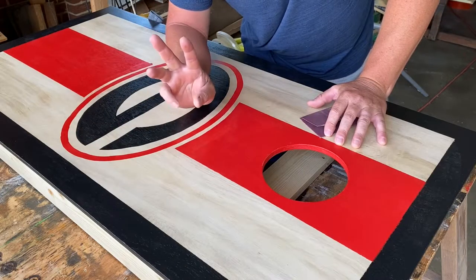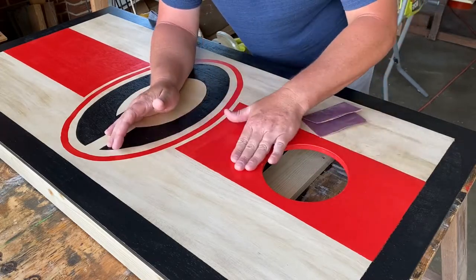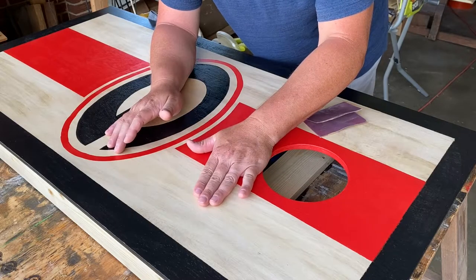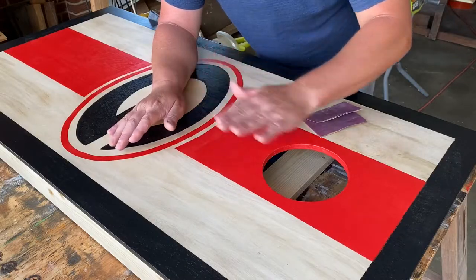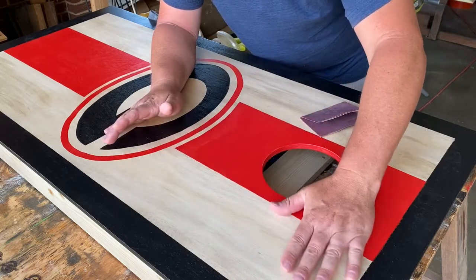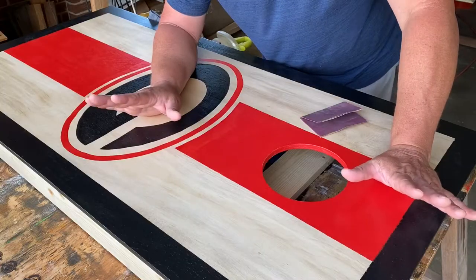The second coat really seems to give it its nice protective layer over everything. So at least two, if not three coats of poly on here. I can feel the difference between the painted surface and the unpainted surface — even though it's got the poly on it, I can still feel the difference. We definitely don't want that. I can also feel that it's smooth, but it's not slick. We want it to be reasonably slick.